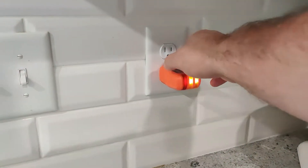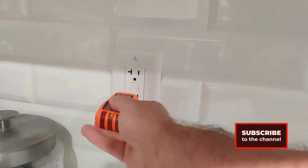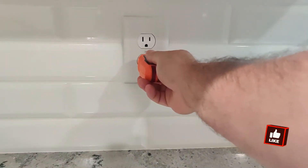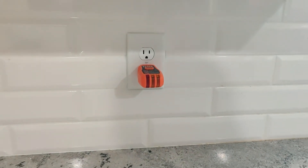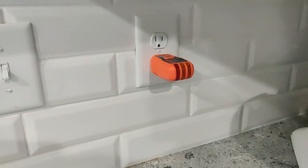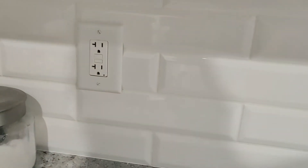An example of this might be a kitchen. In my kitchen, I have a GFCI outlet and then three standard outlets downstream. Those are all protected, assuming they are connected properly to the GFCI and the GFCI is good. A way to test that is to go to your GFCI outlet, hit the test button, which should shut off the power, then go to your downstream outlets, put your tester in, and make sure the power has been shut off. As long as it has been shut off, you know you're GFCI protected. If it hasn't, you'll want to look at replacing the outlets, checking your GFCI wiring, or making sure your GFCI is still good, as they do go bad.